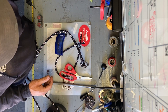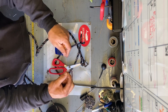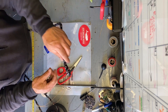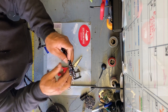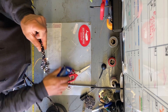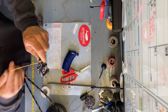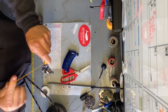Get your wax whipping twine and a needle, thread it up. Go across the core — just like that — cut the ends even, then take your torch, do a quick melt, and pull that molten whipping twine down. Go nice and easy, pulling pretty tight with the whipping twine — that's how you get it nice, tight, and professional looking. Keep going.